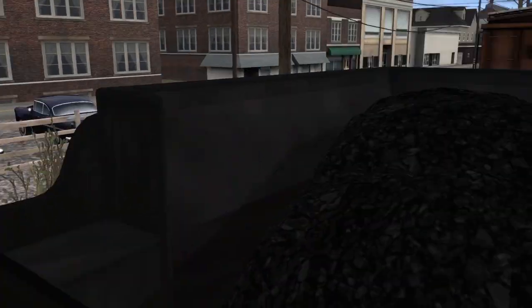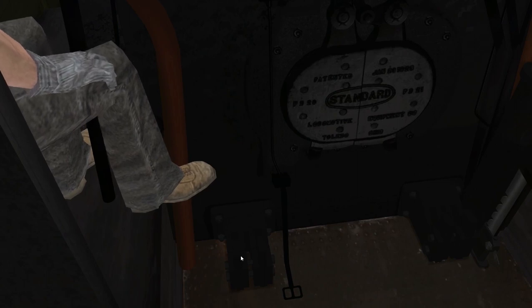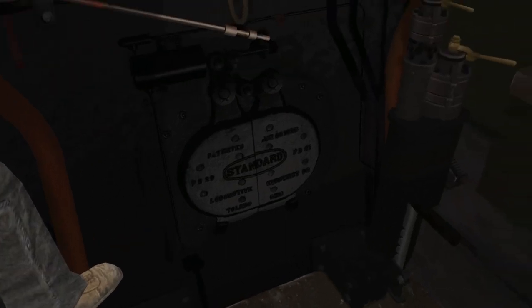The shakers, by the way, just to explain them, periodically you have to clean your fire. You get a lot of ash built up underneath the bed of coal that you have in there, and you need to clean it so you can get air through the grates on the bottom. So what you would do is you come to a stop over a pit or something, and there's a handle. I don't think he has it in here. I don't see it. But there's a big handle, and it goes down on these things and locks in, and you just shake this one, and that one, and that one, and that one. And be very careful not to pull them all the way back, because if you do, it dumps the fire.